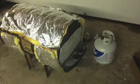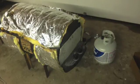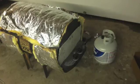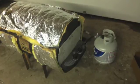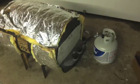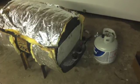In addition, we've also added some blanket insulation to the hotbox. This allows us to easily get to 350°C on the hot end, which we need. We've been taking it up to those temperatures and testing out materials and also testing for leaks and things of that sort.